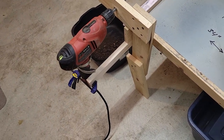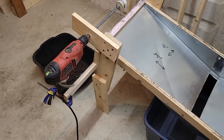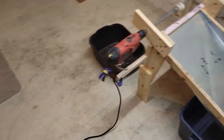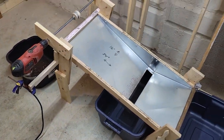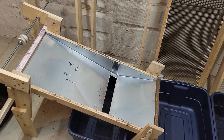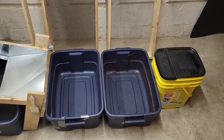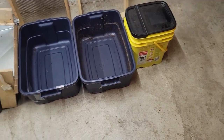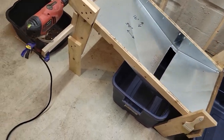The drill speed is controlled by a hose clamp around the trigger — to speed it up I tighten it with a nut driver, to slow it down I loosen it. I recommend plugging it into a power strip so you can just turn it on and off easily. Once you get it set, it's really nice to just flip it on or off. The fine-tuning gets old, but once you get it dialed in it's great. The bucket there is just a heavy bucket to keep this thing from walking across the room when it's running.